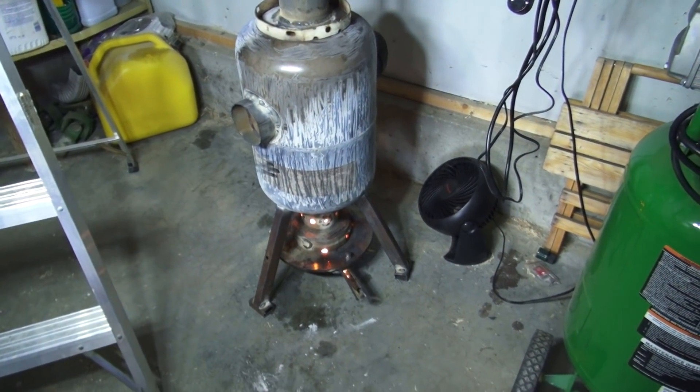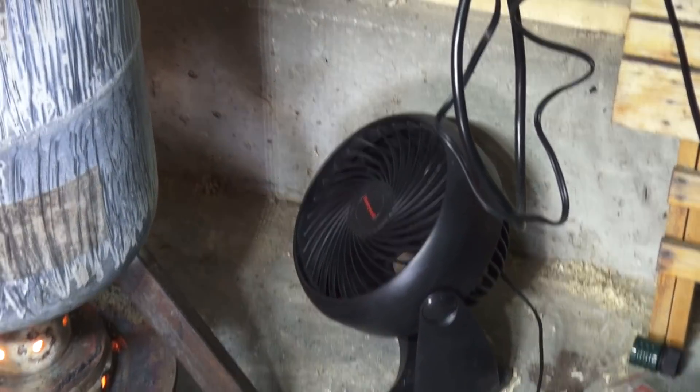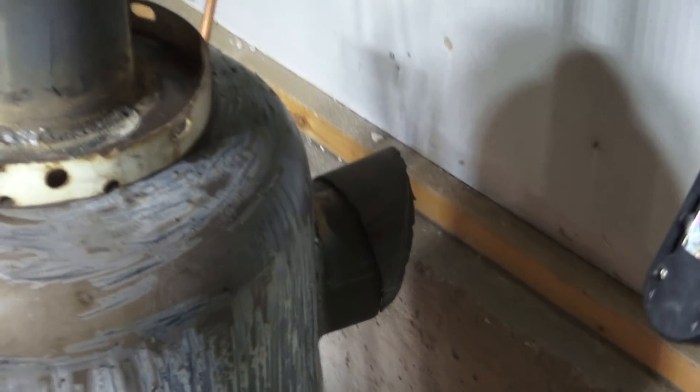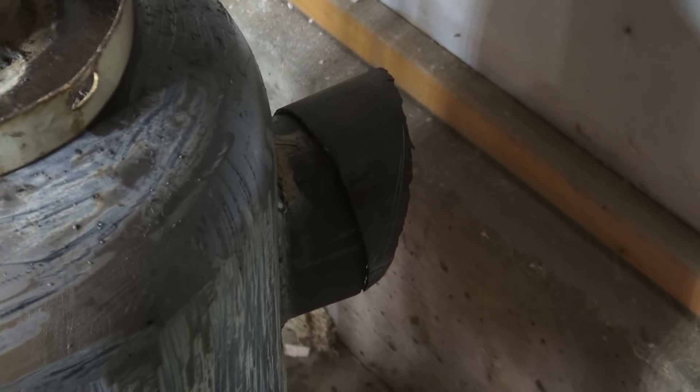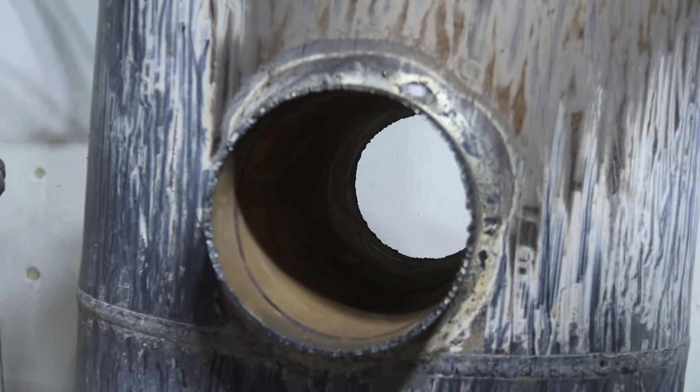What I do now is, with the help of a fan, I increase the heat dispersion. It's blown a little bit into this angle piece of scrap I put on the end of the pipe, so it directs some of that hot air right through the pipe and out of the front of it. It's quite effective for heating like this as well as keeping the heat away from the wall.